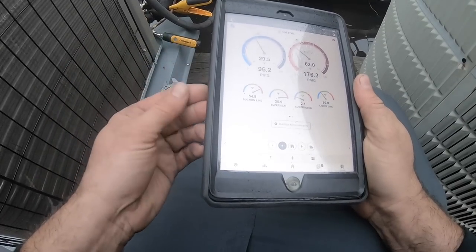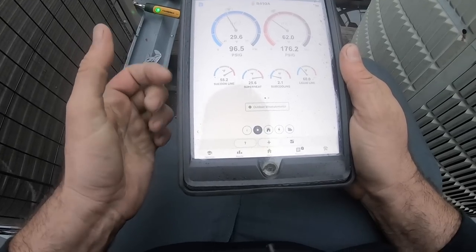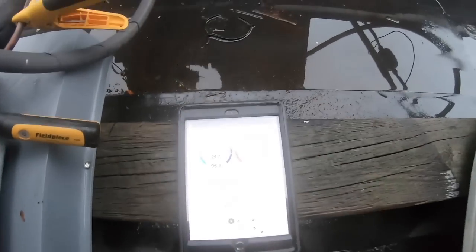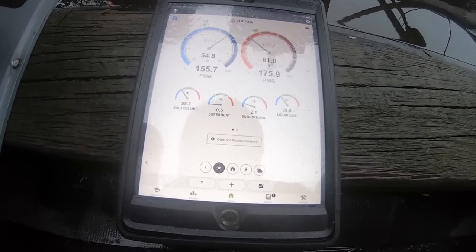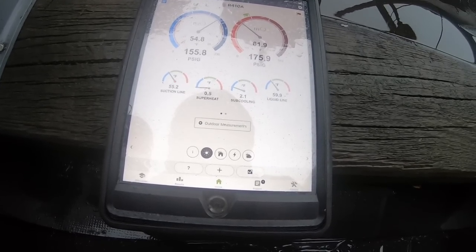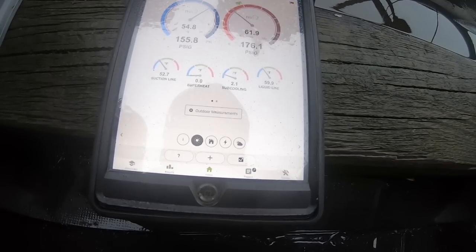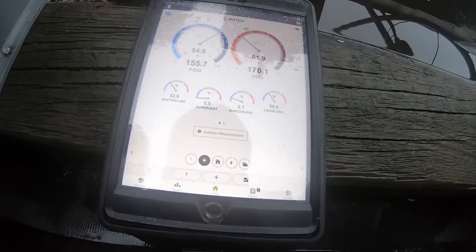Without adding gas right now, it's warming my can up a little bit, hopefully. I mean, 25 superheat's not that bad. Let's put some more in. Once I get to 4 is where I start to get cautious with the subcooling, especially if I need 8, or 9. Whatever it is, it doesn't matter. Getting more pressure when I leave it off for a few minutes.